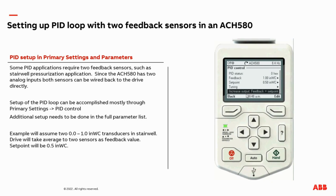We now need to adjust how the drive reacts to the feedback signal being greater than or less than the set point — sometimes called direct or indirect in the industry. In our setup, we want the drive to accelerate the motor when the feedback is less than the set point, so we select 'feedback less than set point means the drive will increase the speed of the motor,' and when the feedback signal is greater than set point, the drive will slow the motor down to a stop. The next option that may also need adjusting is the sleep function. Its summary is: as the drive feedback signal gets close to the set point, the drive will start slowing the motor down, and you can set it to shut off — for example, if running below 20 Hz for more than 10 seconds.